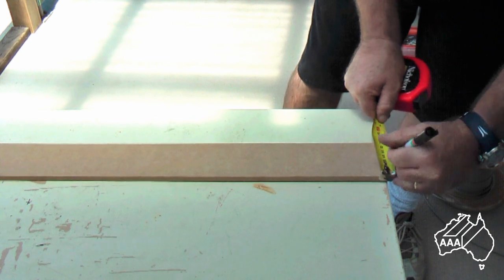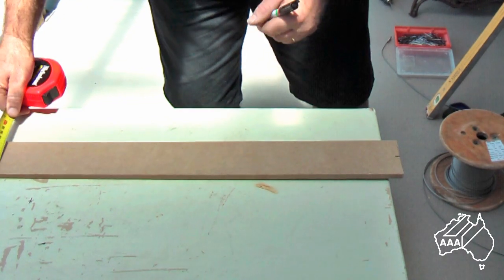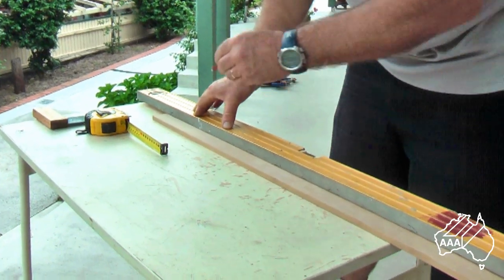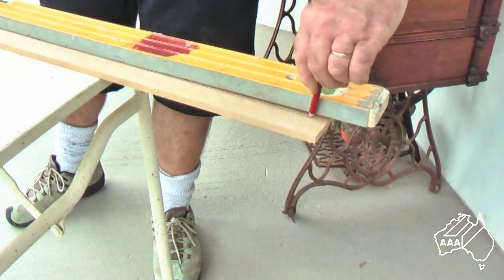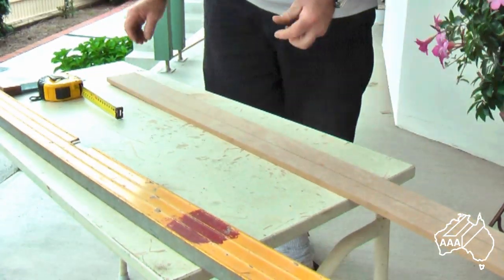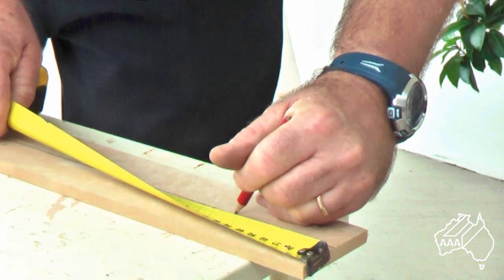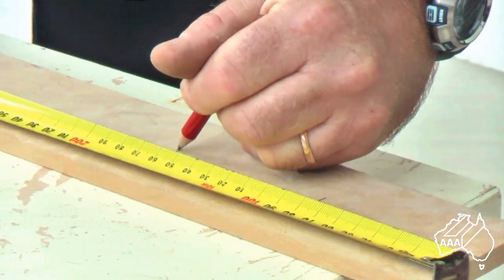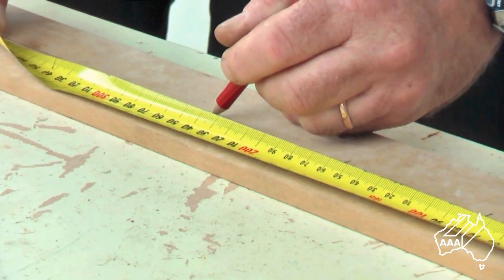First of all, you will need to attach the saddles to the post. To do so, make up a simple template using a scrap piece of board. Next, you will need to make the correct spacings for your wires. Current BCA regulations require that your wires should be spaced at 80mm centres. Here you see the person marking them out.